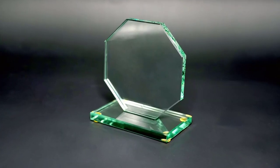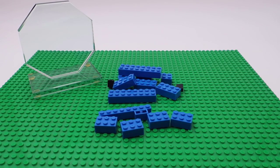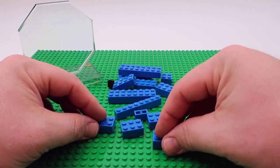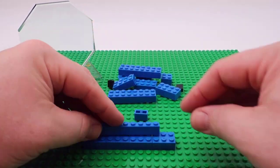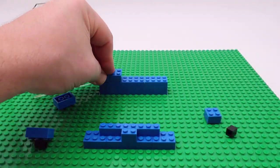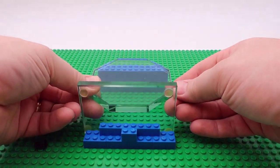When you have the need to laser engrave or mark low quantity, oddly shaped objects, it can sometimes be difficult to hold this kind of part in place on a laser system to provide consistent results. This laser hack will use Lego blocks to do just that, producing a stable, consistent, custom platform to hold these kinds of objects in place when laser processing for quick, low volume repeatability.